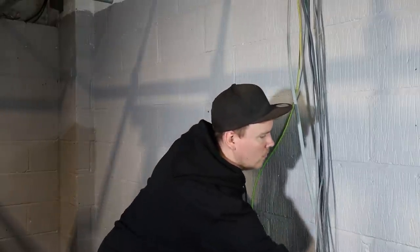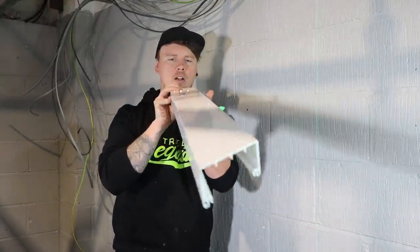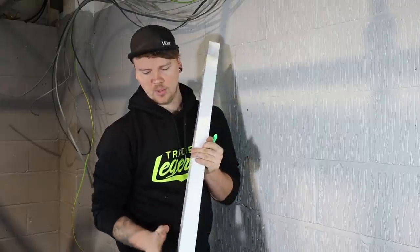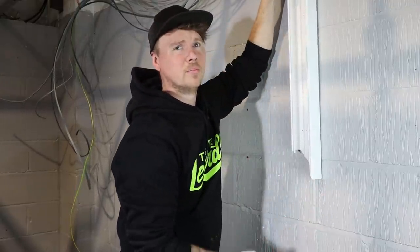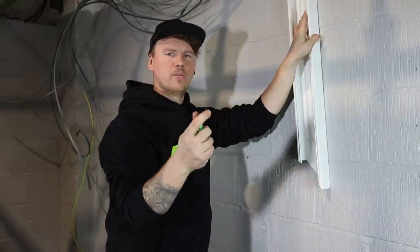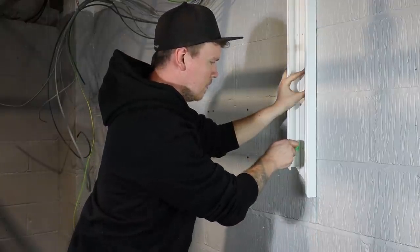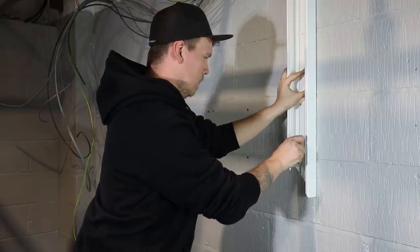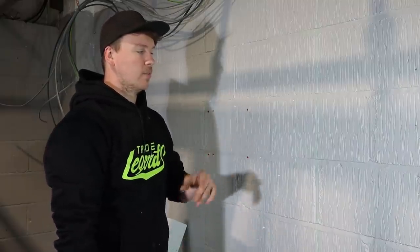I've just set up the laser level - it should be a bit easier to show you guys rather than an actual level. We've got our trunking all cut to length and our holes in the back. I've set the laser up because it's a nice clean wall - make sure we've got our line up against it. Let me just mark these out - we're going to be using the Marksman. It's a green chalk spray that sprays out to go through deep holes in wood - the pen will work fine here, but I've got this to hand so we might as well use it. Now we've got our markings, we're going to get a 5.5 bit, drill all these out, red plug it, get this on the wall, and then the next step is getting the 45 across - making sure that's nice and level and square to itself so we've got no gaps.